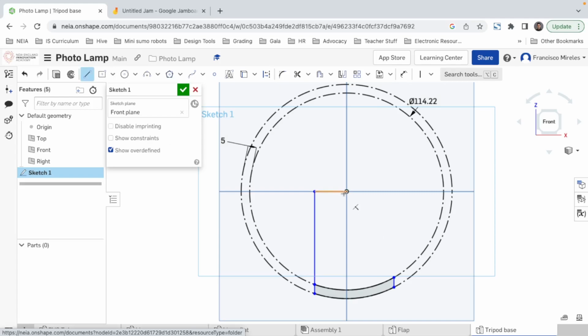And I'll center line because we can mirror. All these lines are gonna be construction lines. Good. And now I can use this tool, this little scissors trimming. So what we can do is cut the things we don't want, like these lines right here, and we just want half of it because we're gonna mirror it. And then we add a dimension line from here to here. We set 5, so it's gonna be 25 millimeters.